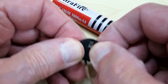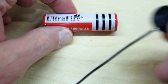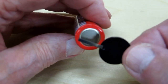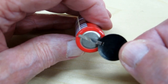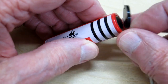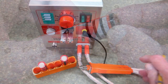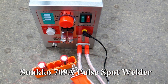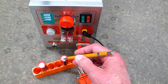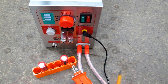That one goes through there like that. This one will eventually get bent this way and go up the length of the battery. The tricky part is we need to spot weld this to the bottom of the battery such that when we fold it over it's nice and concentric and flush all the way around. I'm going to use the spot welding pin — it's a little easier to get in here with the pin to spot weld these strips on here with that plastic insulator and circuit board in the way.